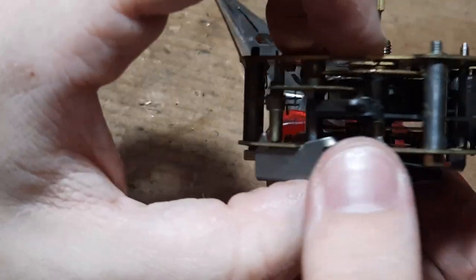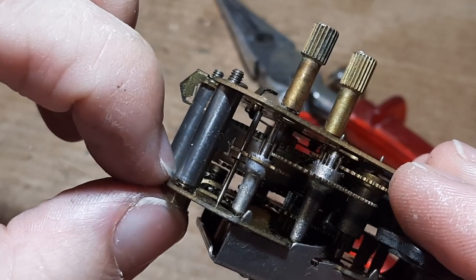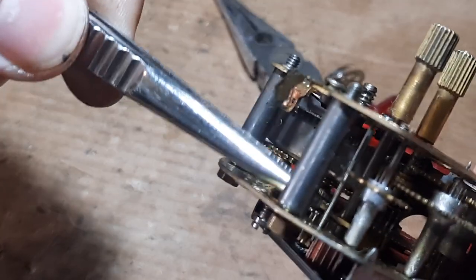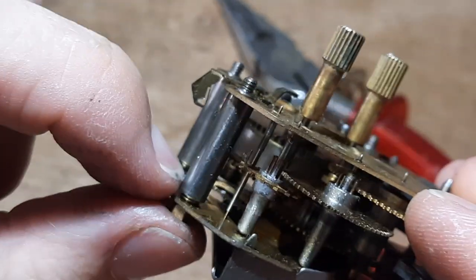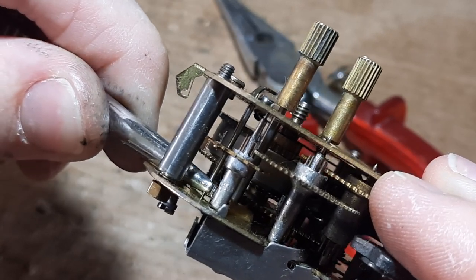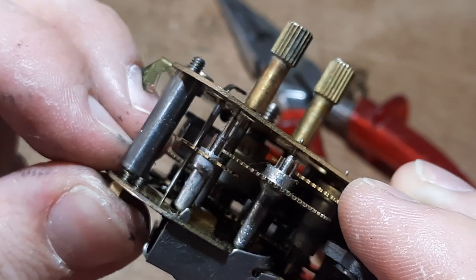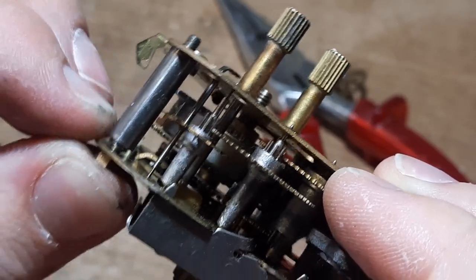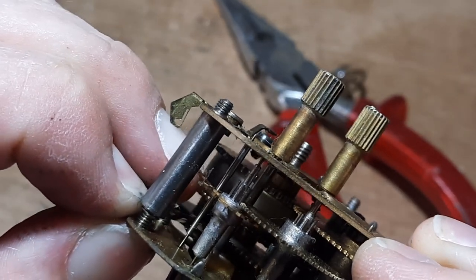With these slightly undone, I'll undo them a tiny bit more, especially these two bottom ones. I will put my finger on this big wheel here just to hold it still - don't put too much force on it because the pivots are quite fragile. I will carefully pop up this plate here - very carefully. What I'm going to try and do is remove this end piece here, the pallet, which is the last tiny little piece in the train of wheels, and I will remove it from the movement. This allows the power to run down without the balance wheel.